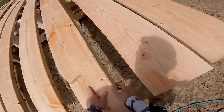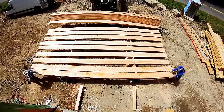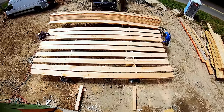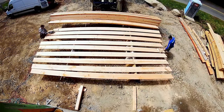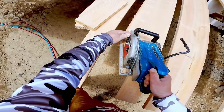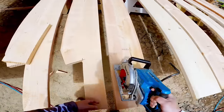As long as the tops are flat, the roof's going to be nice and flat. We don't care about the underside because all of that's going to be in the attic. So that's how you do it. Now, sometimes the opposite is the case, where you might have a big cathedral ceiling, in which case you would flush the bottoms so that the drywall looks flatter. And you might be able to hide some more at the top. So cull your material, and then all of this is a lot easier.